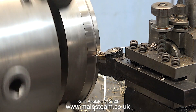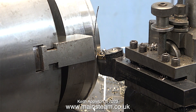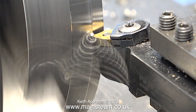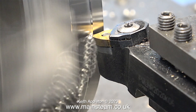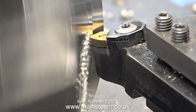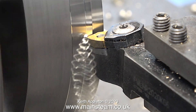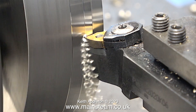I always have the main drive belt to this lathe not particularly over-tight, because in the past I've actually broken tool holders. The tool was locked solid against the piece of stainless steel — I couldn't rotate the chuck in either direction, by hand or under power. When I wound back the cutting tool, the very edge of the tip broke off. A simple fix: I just changed the carbide tip for a new one, and already you can see the difference between the old tip and the new one — look at the finish on the work.